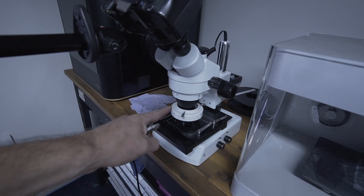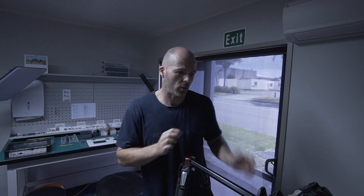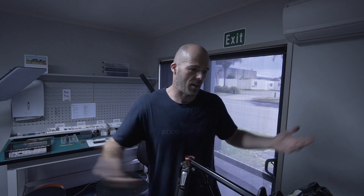Right here is a microscope — we are not messing around. We are really, really making a knife this time. This is the real deal. That edge there — that's a water jet cut edge. We start with a sheet of — I think this is S90V — solid sheet or solid bar, and we water jet cut out the blank. It's actually a little bit harder to see the rough surface than I thought it would be. I know it's rough, I can feel my fingernail rubbing across it, but through this microscope it just looks kind of liney. So that's a bit of a fail really.